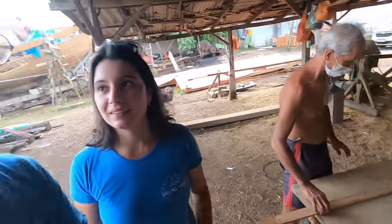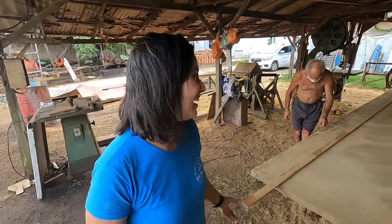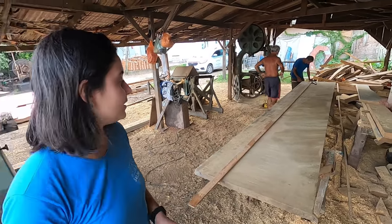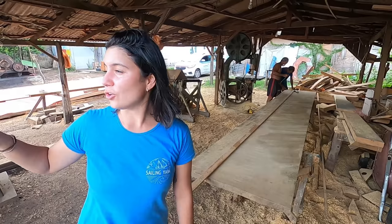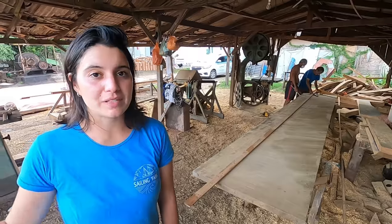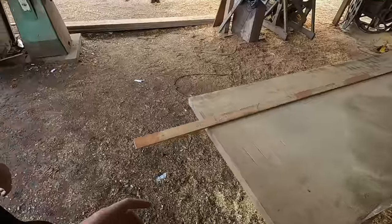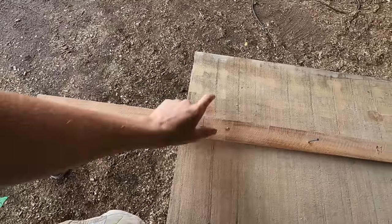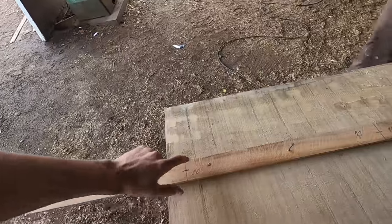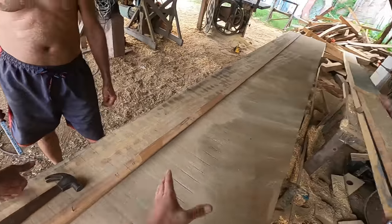So this is the Pasquia rule. I'm learning the way I'm learning. We're in Brazil. It was on the boat to show where this next sheer plank should start and where it should end. So it grabs all the shape and size, and now it's brought here to this huge plank so you can know how to cut it. It also gives us the distance from this point to the edges of the plank so the plank can be cut correctly. So if it's 8 centimeters up, 6 centimeters down, there's more plank on that side than this side, and it can be curved as well.